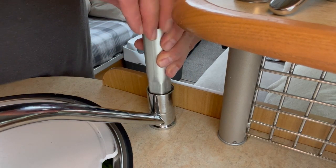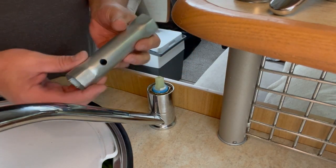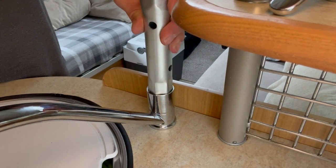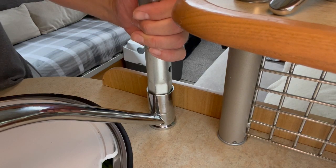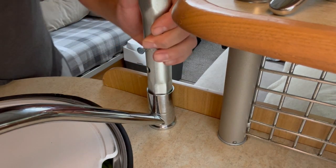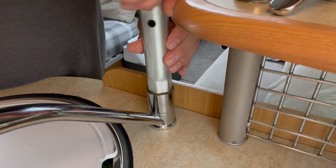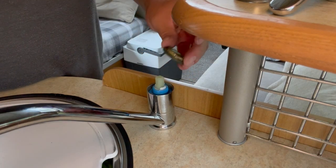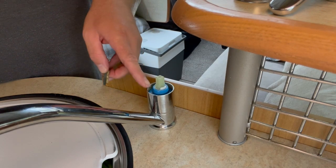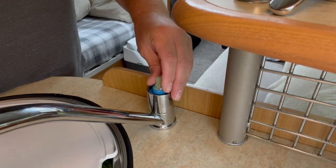You won't get that nut out without the proper tool - that's a box spanner. It just fits in the tight space there. That's a 27 millimeter box spanner - that's the size you need for this type of tap. You should be able to undo it with a big screwdriver. You'll struggle trying to use pliers or mole grips. Take the nut out - see, still no water in there. When they fail, that space is full of water that comes out from the top. That's the nut in question. Next we'll take the cartridge out.